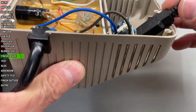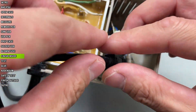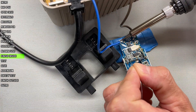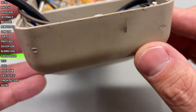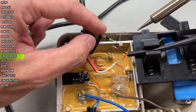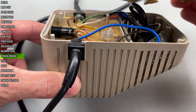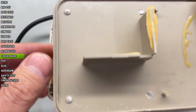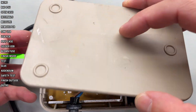Because I don't really want to desolder the board's USB connector, I found out that the whole composition is too tall to fit in the case. So I'll simply reposition the bottom wires. Now to solder and isolate the USB wires. Because I left the other AC wires intact the cover doesn't fit anymore, so I'll just break off the superfluous plastic part. Now it fits.